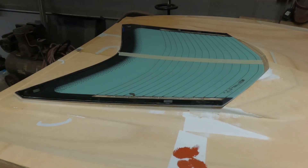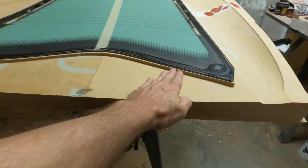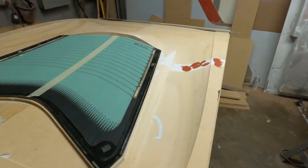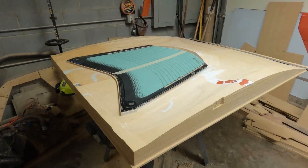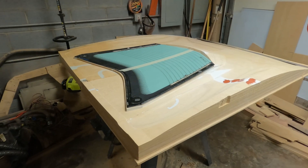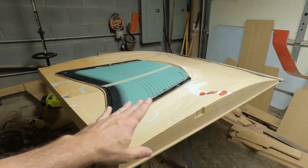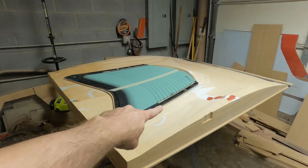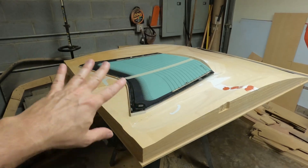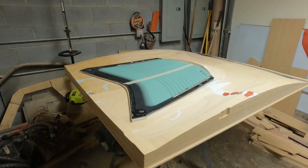All that will have to be blended nicely on both sides. The contour — when I set this down flush — the actual glass touches and sets in the pocket really nicely all the way around the perimeter, so I don't think there are any height issues. My only issue is the outside perimeter shape; the curvature looks correct. So the next thing I need to do is start making dams on the sides and filling in with Bondo, then work this top end with a Dremel tool to get the shape correct before I start any finishing. This half has a coat of glue brushed on it, and I'll wait until the Bondo soaks in before I brush glue on the other half, then start working in high-build primer once the perimeter shape is fixed.